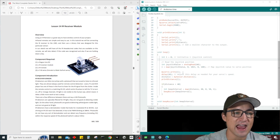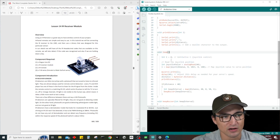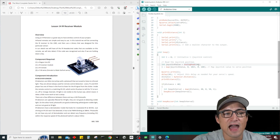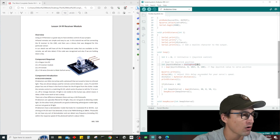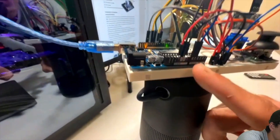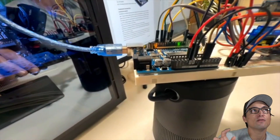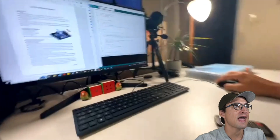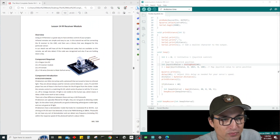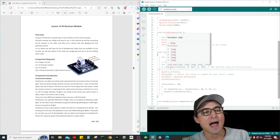The way we were writing the angle was with the iteration variable I. I still kept I, just made it a little different. This time I set I based on the analogRead which is our A0 pin — looking over here, our A0 pin controls the x-coordinates of our joystick, and A1 controls the y-direction. So I'm reading the A0 joystick x-coordinate data into a joystick variable.